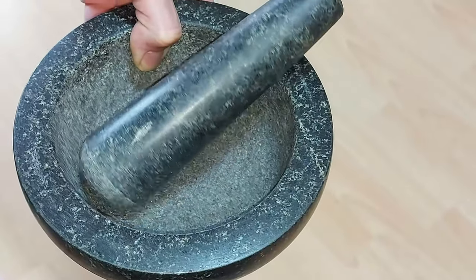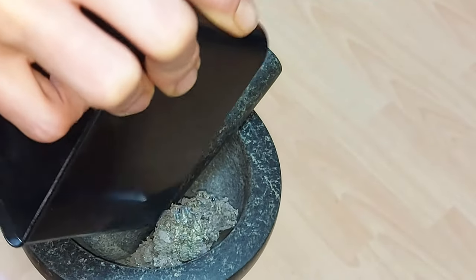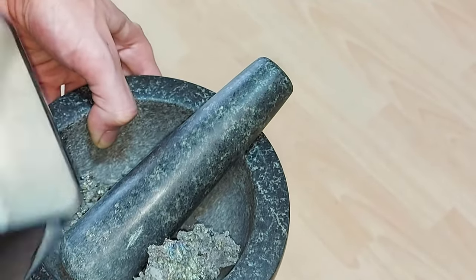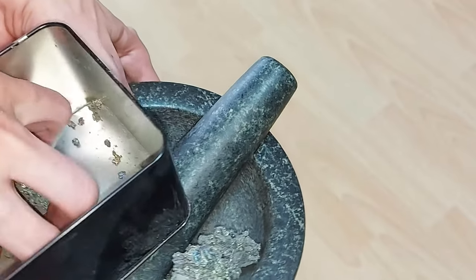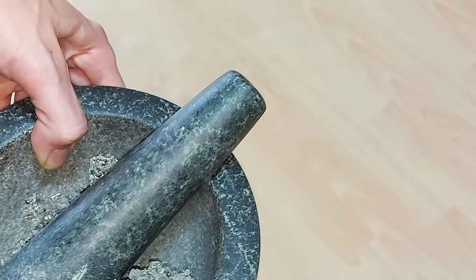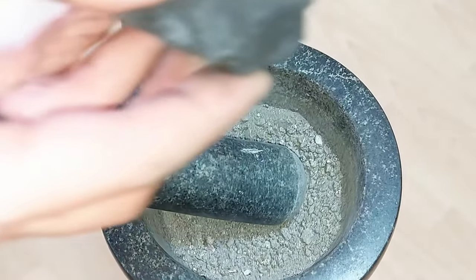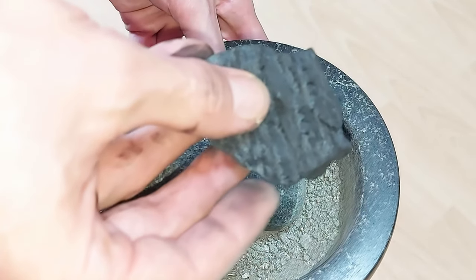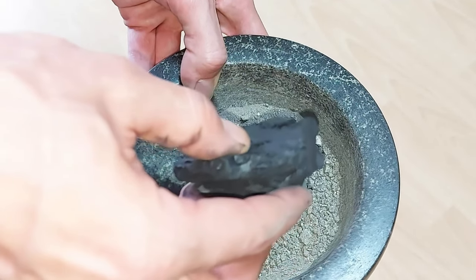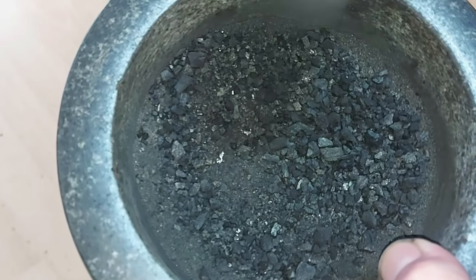The third and last part of this video is a short demonstration of how I begin to pulverize the bismuth oxide with the mortar and pestle. When I am finished I add charcoal pieces into the mix and grind both materials together until both are fine dust. Afterwards I fill the dust mixture into my crucible and top it off with charcoal pieces to prevent any oxygen from getting into the crucible while the reaction is happening.